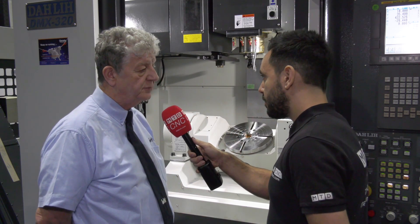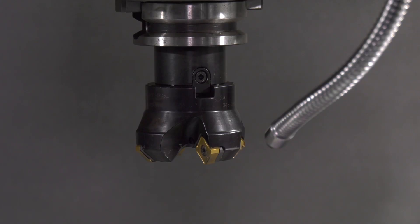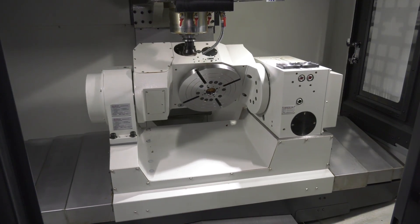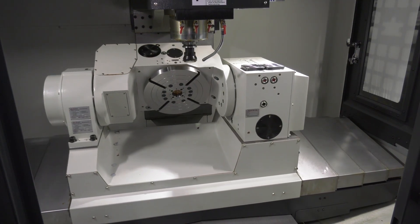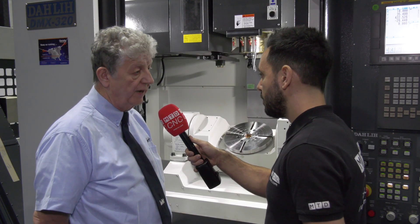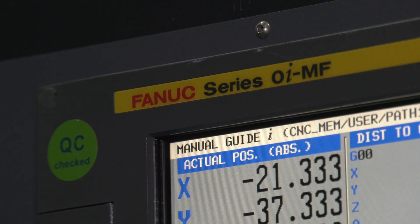It's a very nice specification machine with a lot of traditional benefits — 15,000 rpm, 25 horsepower — and we've got the FANUC feature of tilting working planes. Features which people would normally think of as high-end are now available as standard on this entry level FANUC 0iMF control.